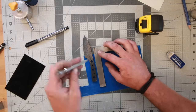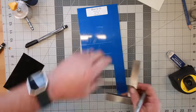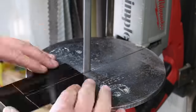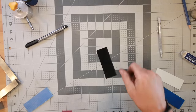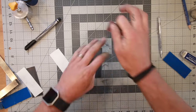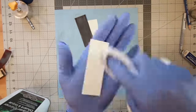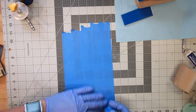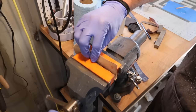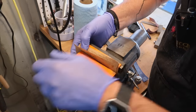The scales for this one, I'm going to use a couple layers of G10. I've got this blue G10 which I believe is only an eighth of an inch thick. I'm just marking out my pieces there and we'll cut those out. Then I'll also cut out a couple of G10 liners — I'm going to do white and black. I'll make them the exact same size and cut those out. I'll rough up all the surfaces with some really aggressive sandpaper to help the epoxy stick when we go to glue these all together. Clean everything up with lacquer thinner, make sure we get all that dust off and get those surfaces prepped. Lay down some tape, mix up some epoxy, and then we'll glue these things. I just use a little craft paper — it's kind of like a wax paper — and make a little sandwich. I like that closed on one side because it keeps the edges nice and level. Then I'll put this in my vise and let that epoxy harden.